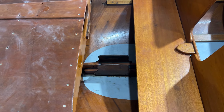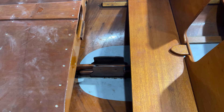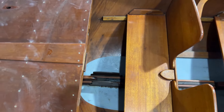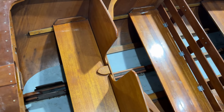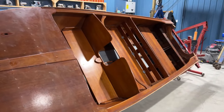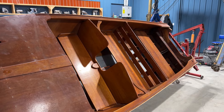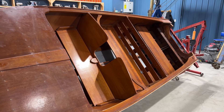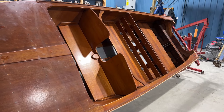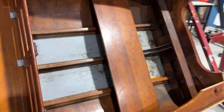There's also a really cool center shift holder — just two pieces of mahogany fastened to the inner keel. The shifter sits down there with some spacers making for a left-hand shift and throttle on this boat, which is really cool. I'll take those out too — they're loose. Anything I can take out with a fastener, except the seat, I'm going to remove to make it easier to work on individually and get them right. I'll probably do some Smith's clear penetrating epoxy sealer on the items in wet areas. The interior of the boat is not going to get restained unless I have to do small repairs.